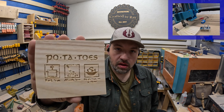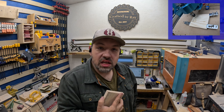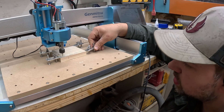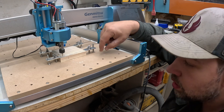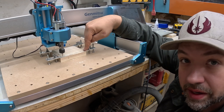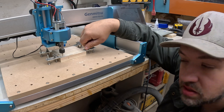As you can see, I did a test cut, but the problem was I messed up and told it to go too deep for the 30-degree V-bit. Now I'm using Easel Pro to run this machine — they also have their own software, but I'm just more familiar with Easel because you can use it for multiple machines. I went in an eighth of an inch — I'm going to back it off to about half that and see if I get a better result. This is on some ash. One thing I wanted to point out is how cool these clamps are. You can place this screw to set the height of your material, screw it into one of the threaded inserts in the board, slide it up to your wood, and just tighten it down with the wing nut. The only thing that worries me is they're metal, so I might make some out of wood eventually, or just be careful not to run them into the bit.